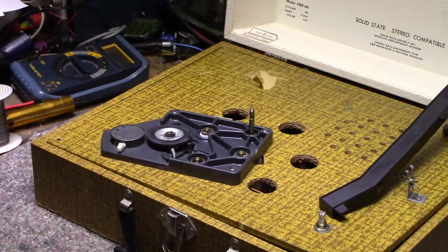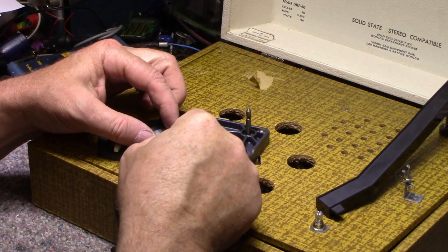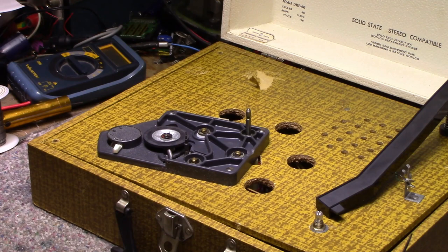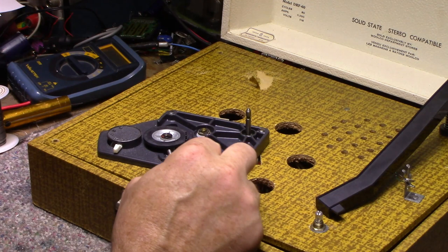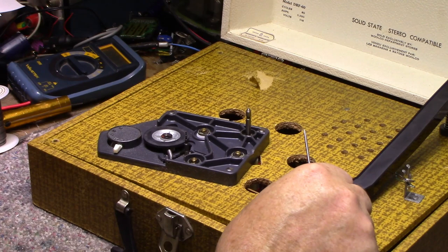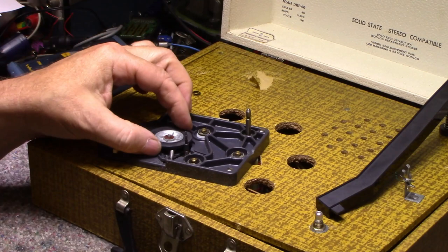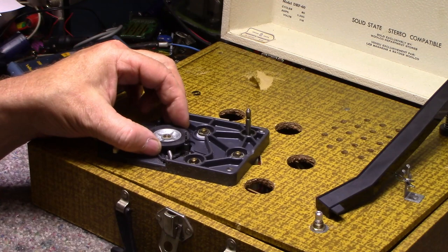One thing I want to do is service this motor and drive assemblies, make it a little quieter. I already put a drop of oil on the motor itself. I don't think the motor is a problem. If I turn the motor on, you can't even hear it. It's spinning. And it's silent. Okay, let's do this bearing. Got a C-clip. Washer. And we got a dry bearing here. So let's clean this up.